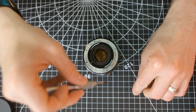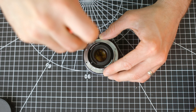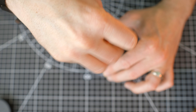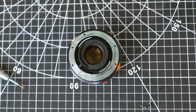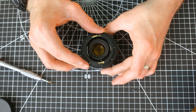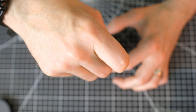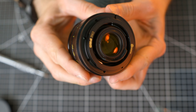For Leica R, remove five of the six native screws. A good technique to avoid stripping the screws is to apply firm downward pressure and twist. If the screw doesn't pop loose, use the heating technique mentioned earlier. Leave one screw in to hold the native mount in place — do not remove the native mount. Place the SIM mount on top of the native mount and align the holes accordingly. Using the supplied screws, tighten down the mount. If you turn and position the SIM mount logo by a few holes, you can mount the lens cine-side, having the markings point sideways.